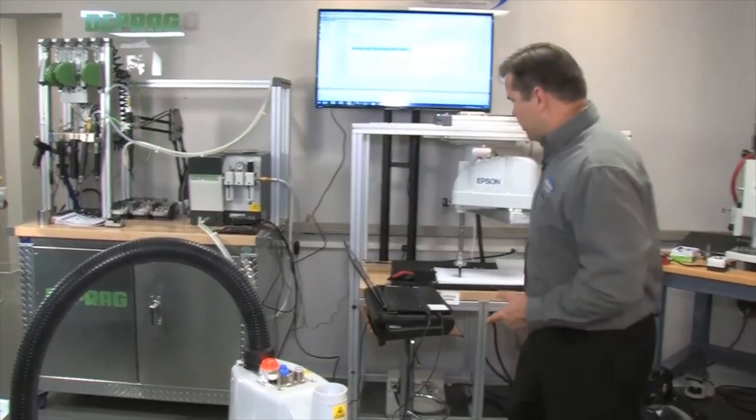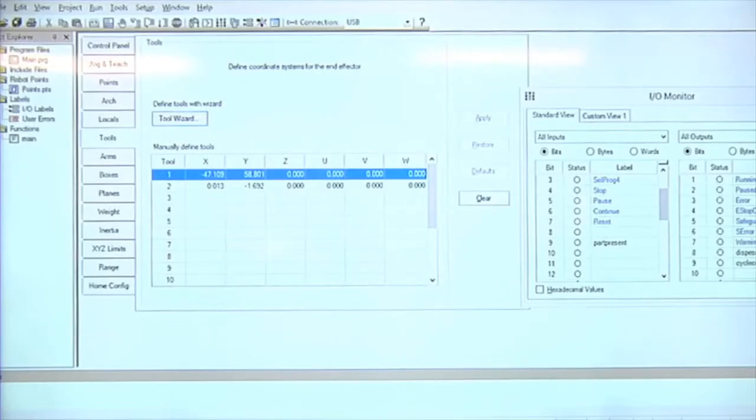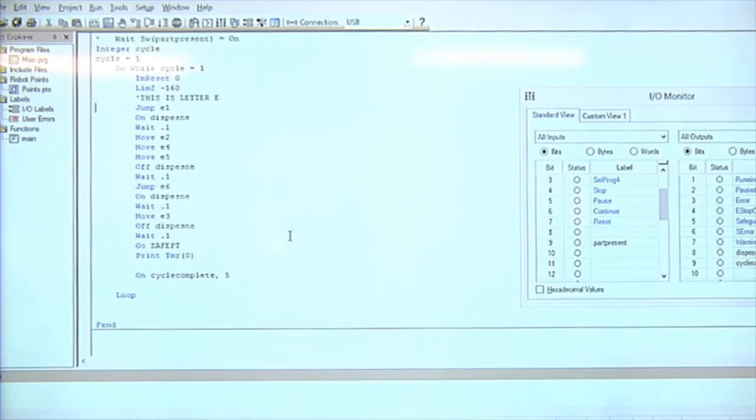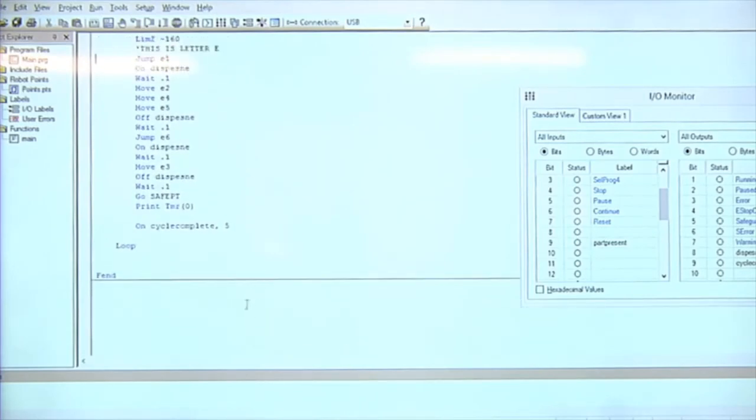So in our code, we're going to clean up the code here to have a little space. In fact, we're going to kill two birds with one stone. We're going to scroll down to the bottom of your program here, and you see this gray line here. We're going to type another function, and we're going to call it function pallet exp or pallet test. What we did is we just created another function. It's really a nice thing because you can have multiple functions, up to 32 in the RC180.